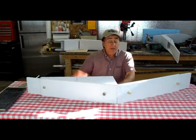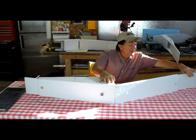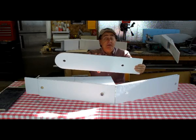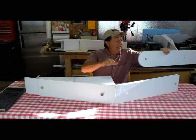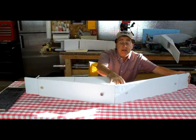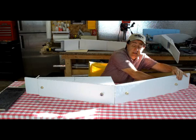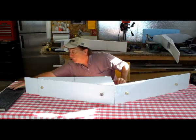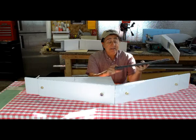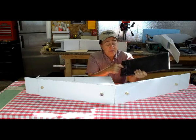This was set up to have two pins on each side — not this size of course — and then this tongue would be attached to the wing panel. It would stick out of the end of the wing, a very stout component, and you'd slide it into the cockpit area. There's a centering system that grabs the half-round end to line up the holes, and you slip the pins in. That design is an outgrowth of what we did for some of the spar testing on the full-size wing section — here's a chunk off one of those tests.